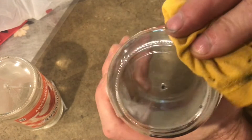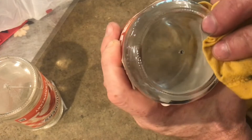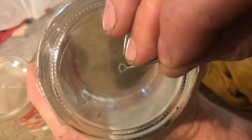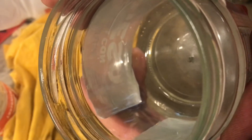Let's go ahead and clean off this kerosene and glass mixture. You can see that this hole is very centered and very clean. I'm gonna dig some of the debris out with this nail, but whatever you do don't twist the nail too hard and snap the glass. A hole all the way through glass — if you wanted bigger holes you can get bigger tools to make bigger holes.